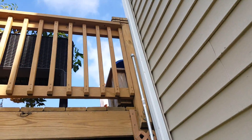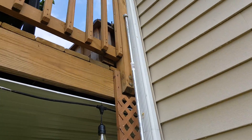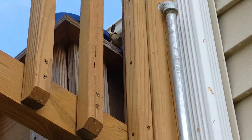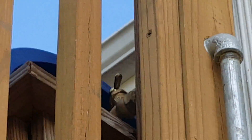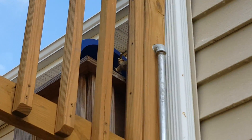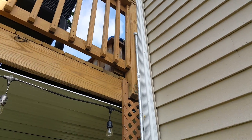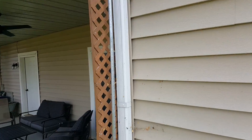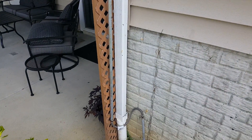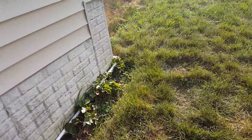I went up ten feet to the top of the deck, drilled a one-inch hole, and put about a four-inch nipple through the PVC. Then you can see there's a regular faucet screwed on the end of that. Watch Carry's video to see how he used thread paste on everything. I just finished it so I still have to bury it, but it works great.